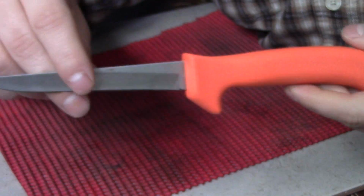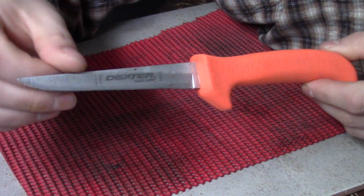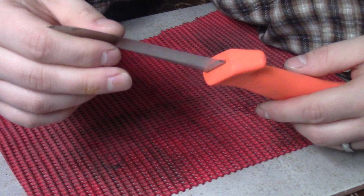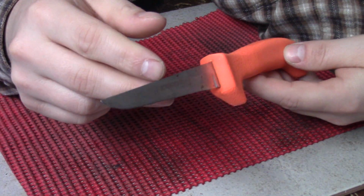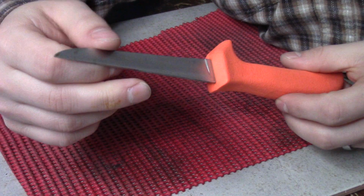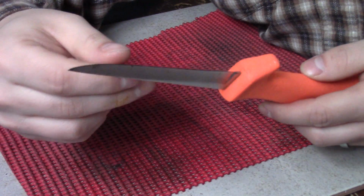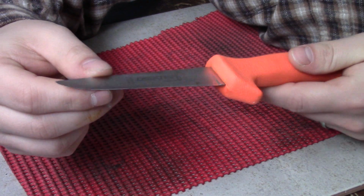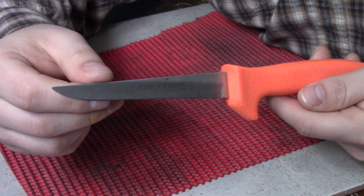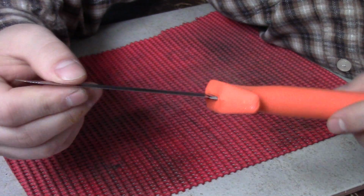I work with Atlantic Sharpening, work with Ray Bartlett. We have a little company started, and we've been getting lots of business. But one of our principles we always use is remove as little steel as possible to get the perfect edge. We always send our knives back with perfect edges, mirror polished, razor, shaving sharp. But we do that in a way that preserves the life of the tool. And you want to do that. You pay a lot for these tools, and you don't want to just be wearing them away for no reason and carving away at your steel all the time. So use the least invasive approach, least aggressive approach. Remove as little steel as possible. So pay attention when you're about to start sharpening. Have a look at your edge, and choose the best place to start. That'll make you efficient, make you fast at your work, but also preserve the life of that knife.